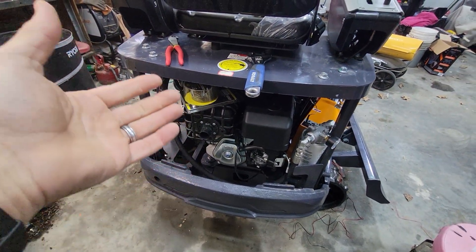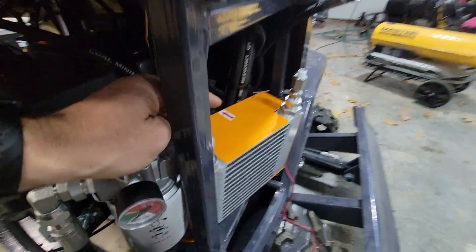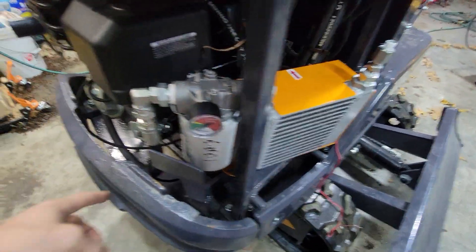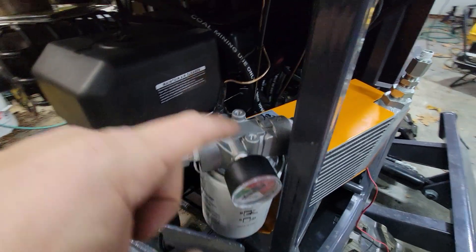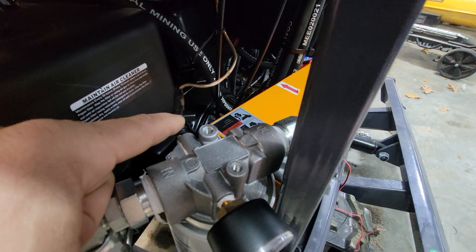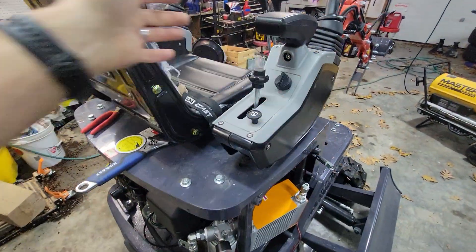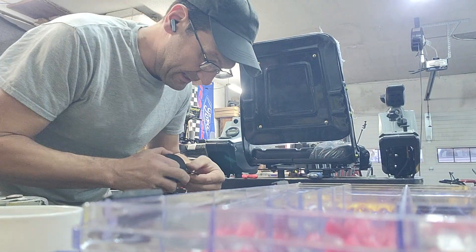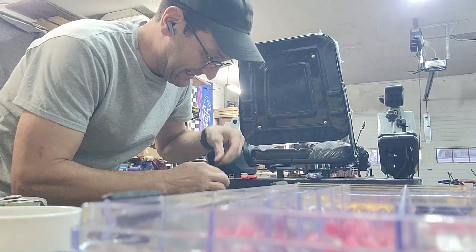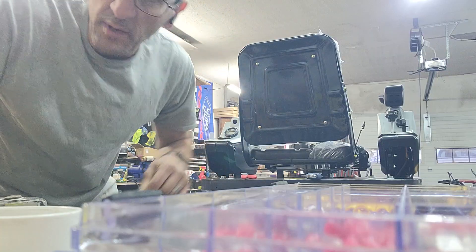Welcome back to this mess. I'm trying really hard to get the cooler up. Think of it as a radiator — oil comes in, goes through the filter, tells us if the filter's clean or not, and then we added a thermometer to tell us how warm it is. This cools it down and pumps it all the way back. The whole machine is taken apart, but my goal is to get it up and running today so we can do a muck out. Hopefully get this thing going and get into Cassie's Castle and muck it out.